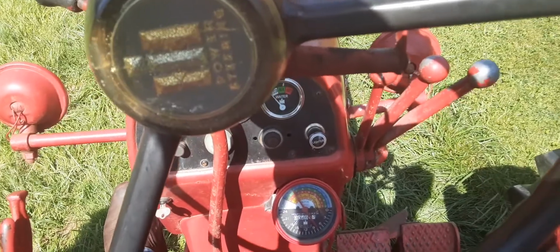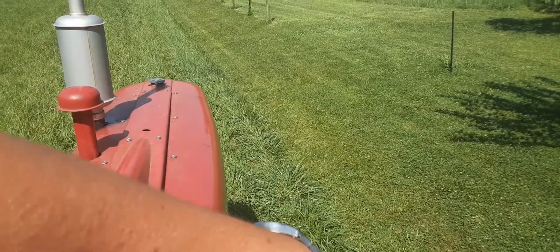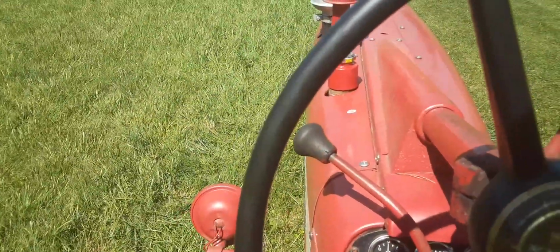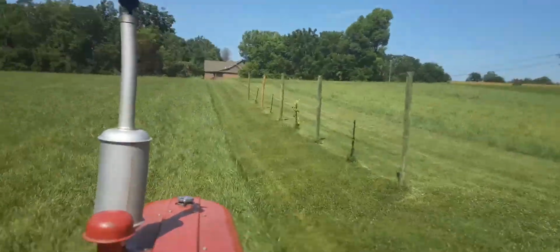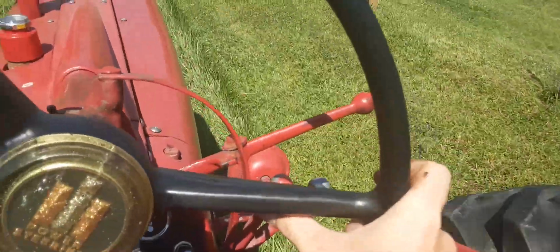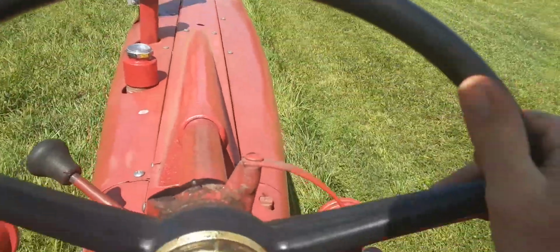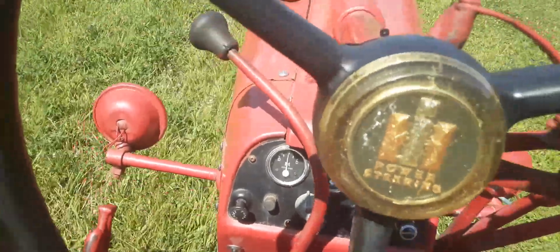Second gear, high torque. Probably start about right there. Take off, then you put it on up to your RPMs. And you let out on that clutch easy. Then you come over here. I already know where it needs to be at on the throttle piece here, so I just kind of know where to set it. You'll learn that, of course, and away you go.